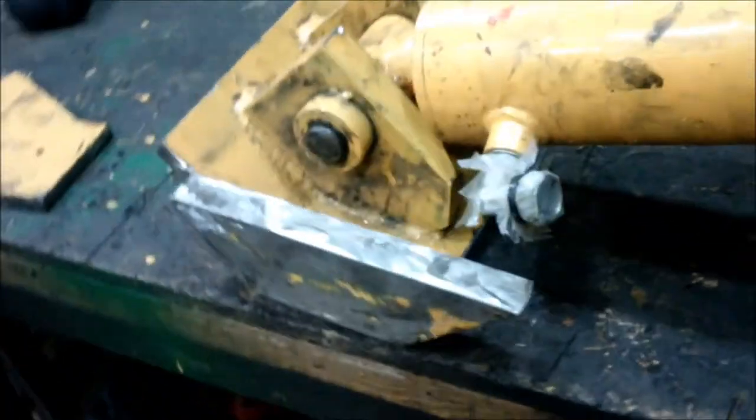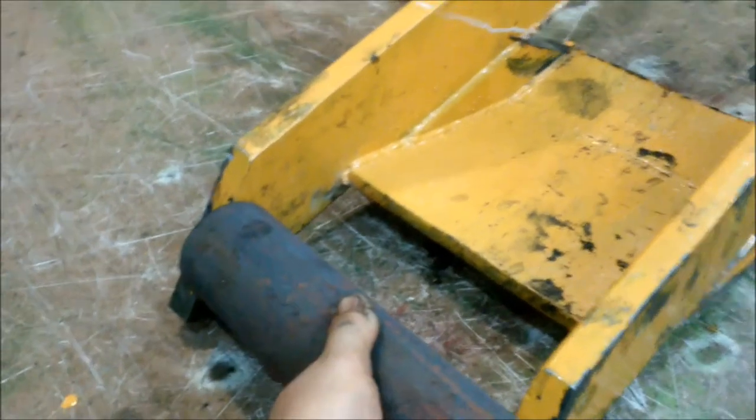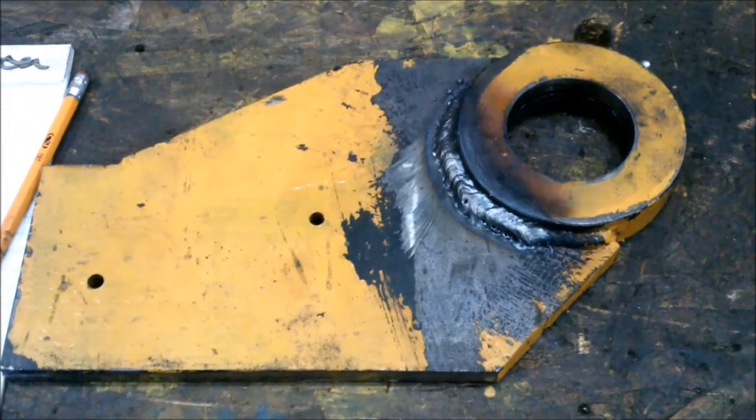I re-welded those cracks and adapted the design a bit — cut everything out. This is all I'll have for the hydraulic cylinder pin; the clearances should fit. Now I need to put in another piece here, get some real iron that doesn't snap, and fit it in like this. Then weld these back on. This time I'm going to take a three-inch pipe and fit it in between the ends for extra stability. Also this half-inch plate actually bent, so I'm going to put another half-inch plate on top and weld it all together for extra strength.